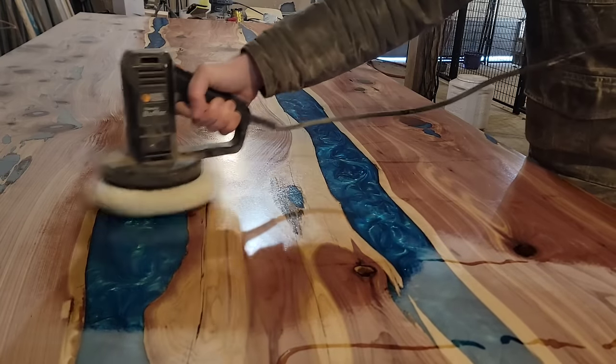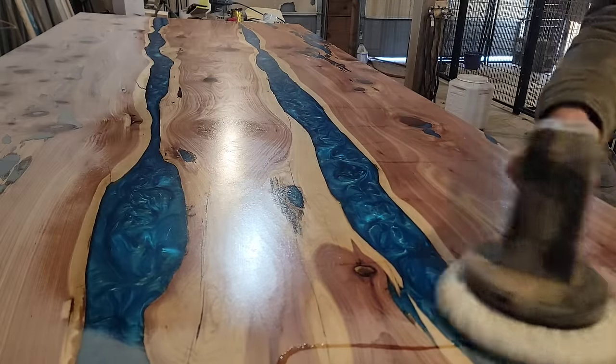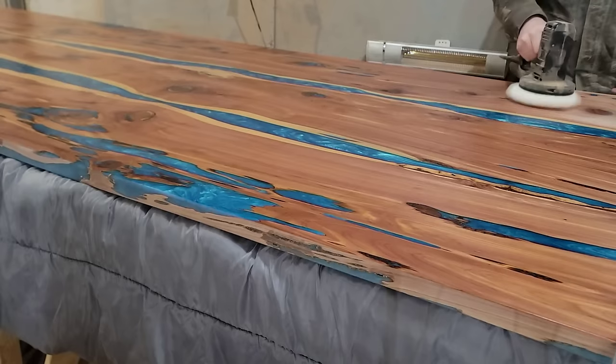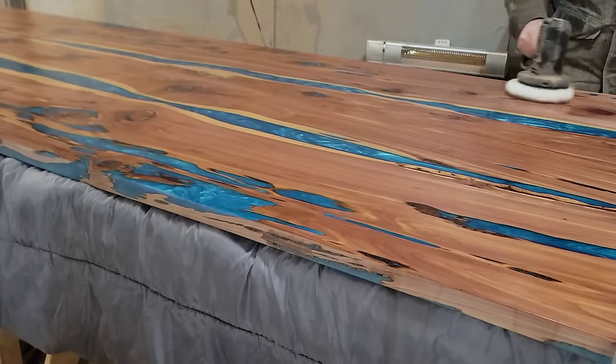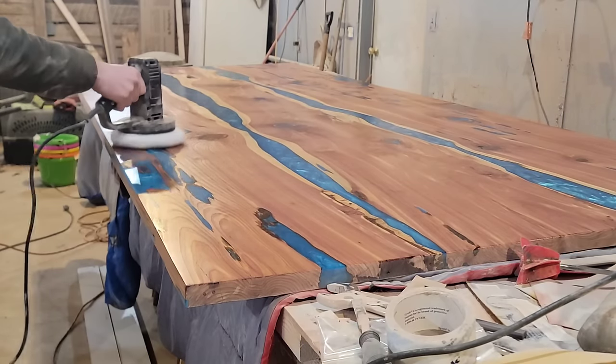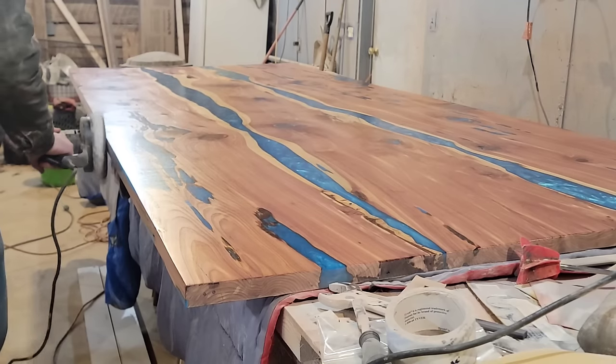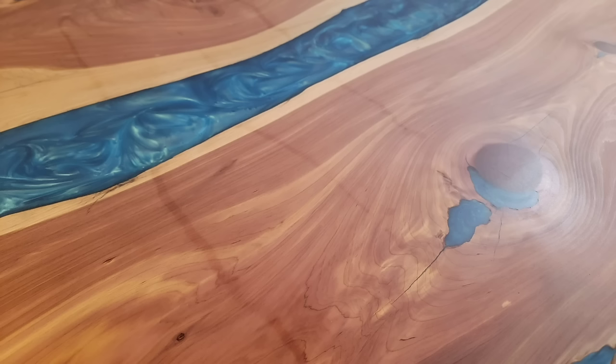And I couldn't find a whole lot of good information online or on the jar about how to fix that, so I wound up contacting Odie's Oil. And the gist of what they told me was that I could try putting a second coat on. If it's cedar, because cedar is a soft wood, it can probably take more than one coat, like two or three coats. But even if the table is fully saturated with Odie's Oil, eventually there's enough oil in the table that it will blend to the rest of the dark lines. You can see those dark lines here. Eventually, what they're telling me is that the table should wind up matching those lines.